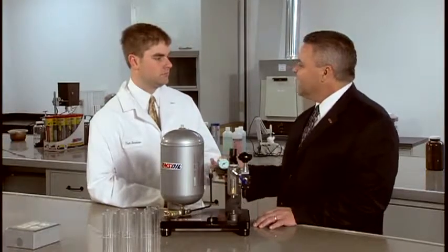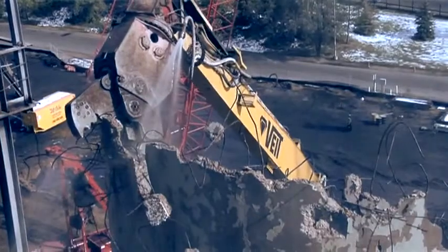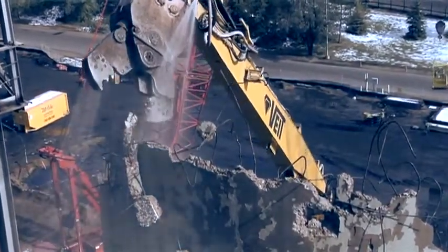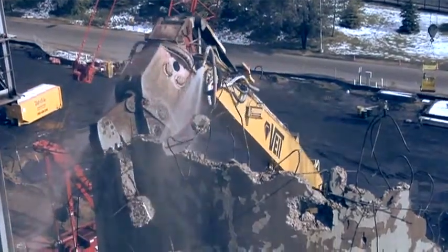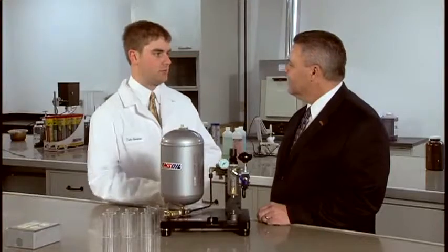So now pound out, what exactly are you talking about when you say pound out? Pound out is really when a big piece of equipment slams repetitively either into earth or rock, or just slams the bucket repetitively back and forth. When you see that bucket coming up and down on a front end loader, say? That's exactly right. When that occurs, all of that pressure from that heavy load is pushed directly onto the pins that hold that bucket to the piece of equipment.